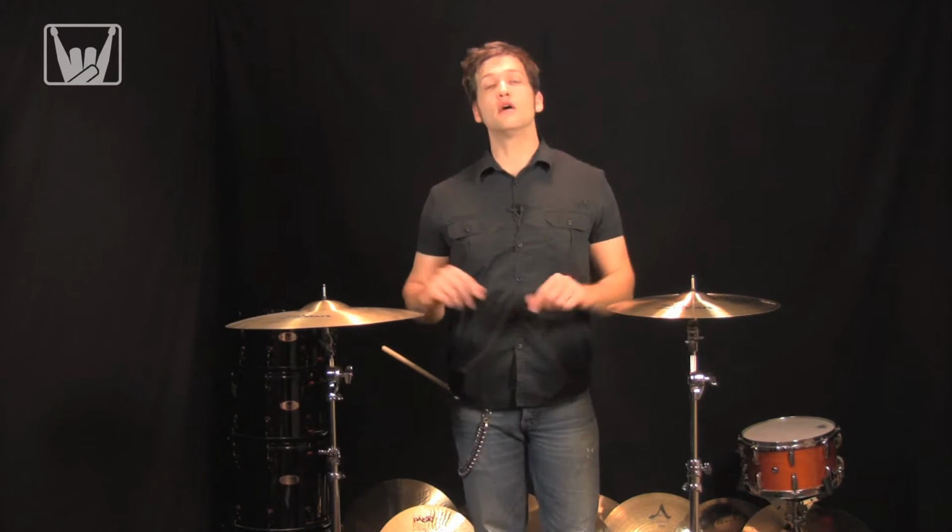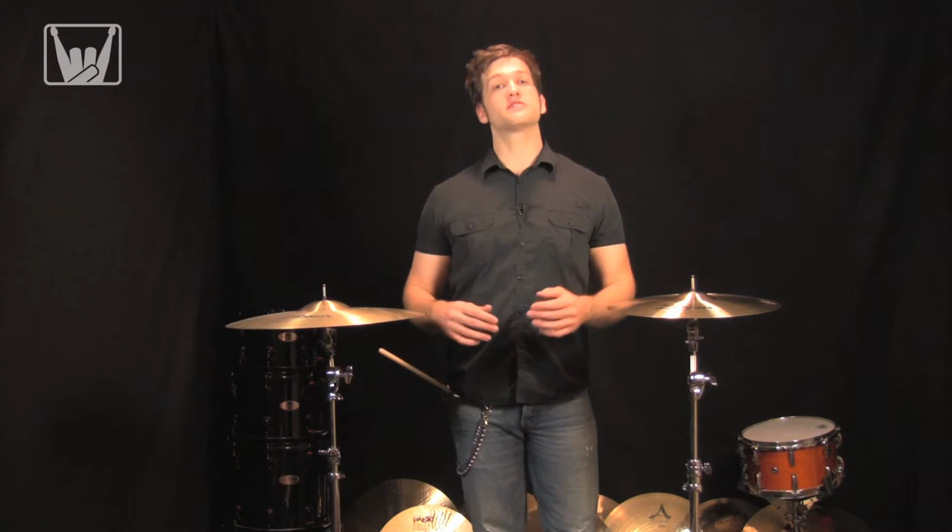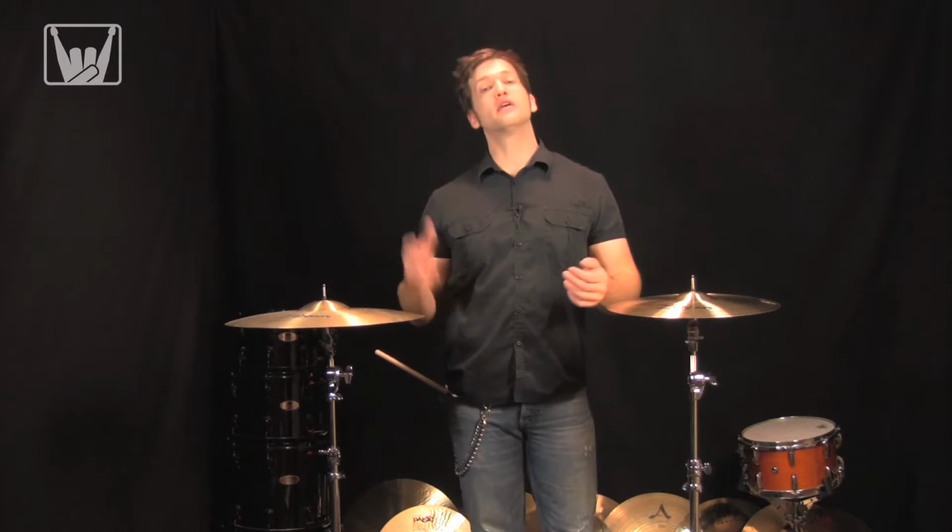When you go to a drum shop, you might hear people talk about a B8 or a B20 or a B10. What does it all mean? Well, it's the ratios of what the cymbal is made out of. So if someone talks about a B20 cymbal, it means it's going to be 80% copper, 20% tin. A B8 cymbal is going to be 92% copper, 8% tin, and so on and so forth.